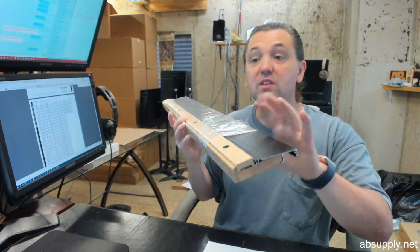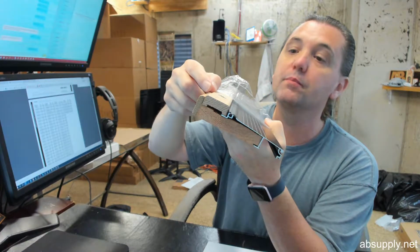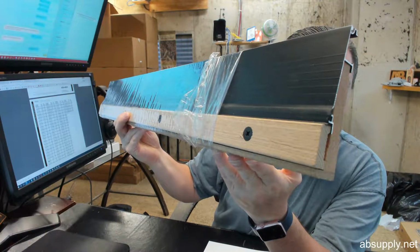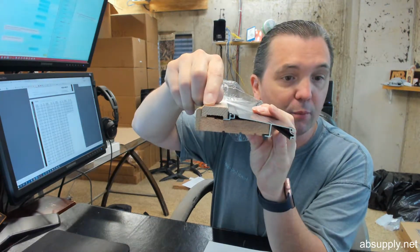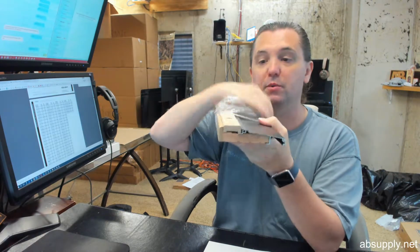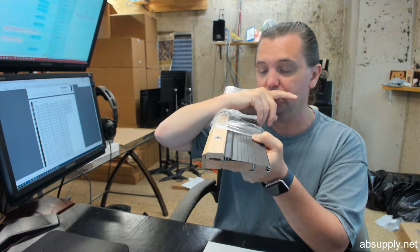The W in the part number means that this is a wood adjustable top. Okay, piece of oak material that's there. Now the W is important to have listed there because you can do adjustable top thresholds from Pemko other than wood. You can do the aluminum adjustable top, and simply that would give you this piece, however made of aluminum. And to get that part number, you would simply drop the W in this part number to get the aluminum version of this.